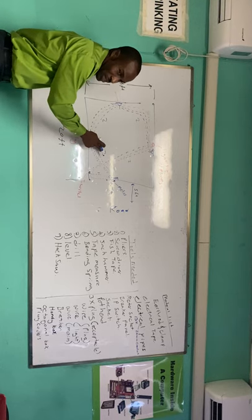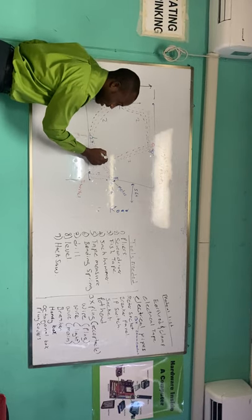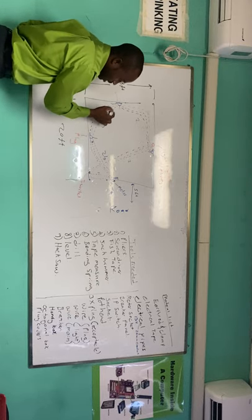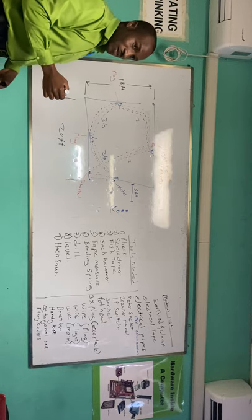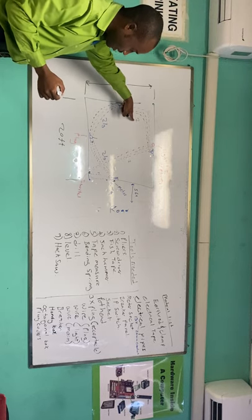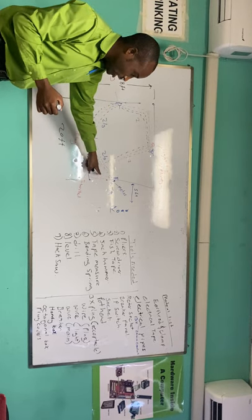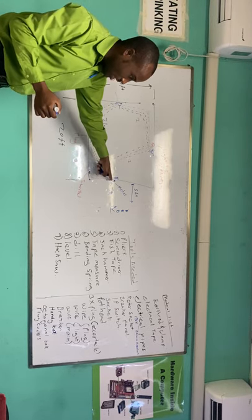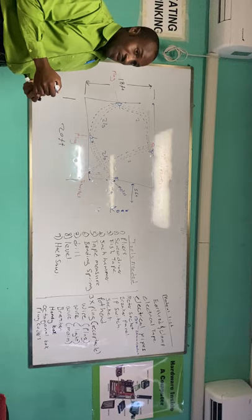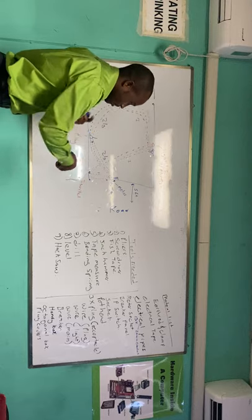To represent 20 feet, that's two lengths per run — from here to here, here to here, and here to here. So 20 and 20 makes 40, and 20 more makes 60, and another 20 makes 80, then you need an extra 10 to reach 90, and one more extension makes 100. So I'm taking 13 lengths, adding extra because you might have to turn up and turn down inside the walls.